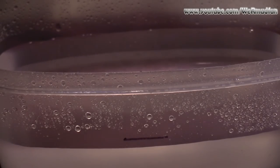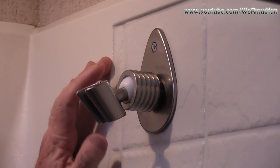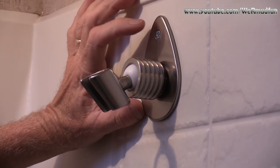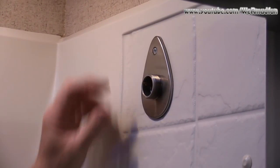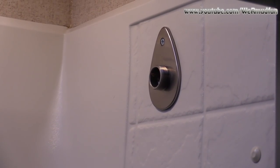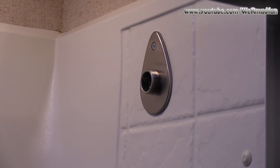So now we have to put the wall mount on. That's the old shower mount — I'm going to take those two screws out and see if we can use at least one of them for the new shower mount. What we did is use the top hole from the old one. This is only temporary — there are two screws on this, the other one is behind. You just unscrew the ball and take it off, and there's another hole right there. So I'm going to drill a hole, then screw it in, back everything out, put a bead of silicone on the underside, put it up, mount it, and seal it on the outside.